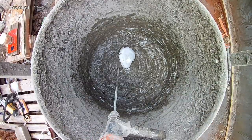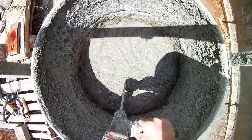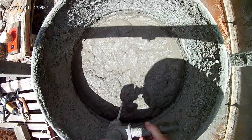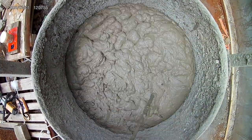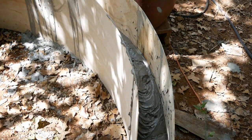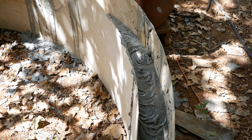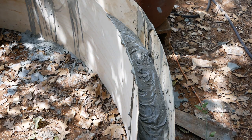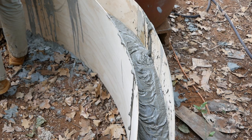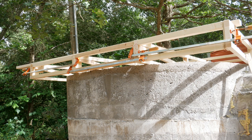After mixing your aircrete to six cubic feet, I just took a five-gallon bucket and bucketed out the aircrete to fill the form. A nice thing about a round form is it's self-supporting. Fill the form with aircrete to no more than about 16 inches maximum per day — 12 inches is more realistic — so it's going to take about eight to nine days. At the very top we finish with a bond beam to distribute the load of the roof over the aircrete, which is a softer material.